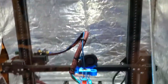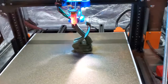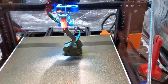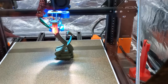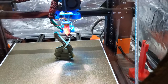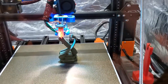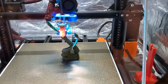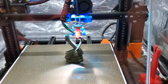You can see the LED lighting keeps things really nice and bright in there, which is helpful for me to be able to see what's going on. This print, although it's bouncing as it's doing pillars like this — as far as my speeds right now, my acceleration is at 2200 millimeters per second squared. I haven't been able to get an accelerometer to work yet, so eventually I'll have better acceleration speed and better input shaping parameters for Klipper. Right now I'm using previously measured stuff as a baseline.